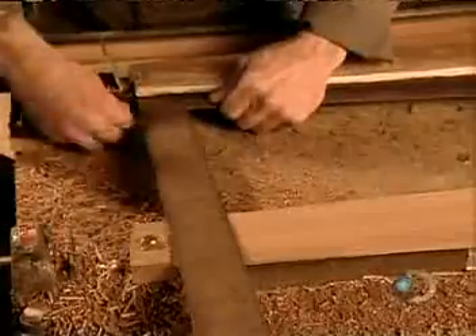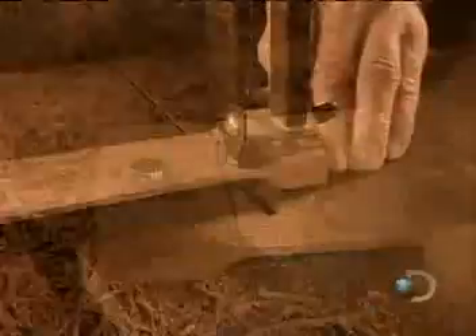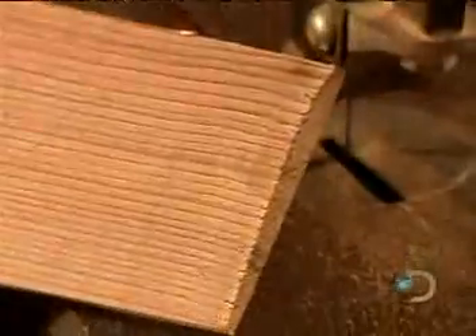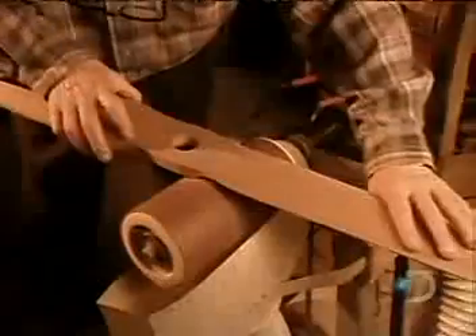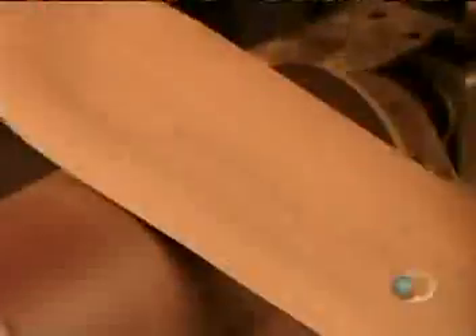You can see the profile well once they've marked and cut off the excess on the ends. One side is flat, while the other is curved like an airplane's wing. Now they widen the hole in the middle of the propeller and sand off the ridges left by the carving using a low-pressure inflatable drum sander — the only type flexible enough to really get into the curves.